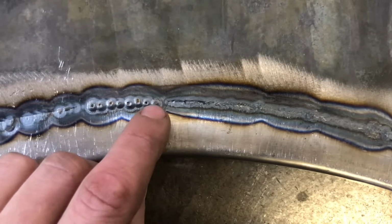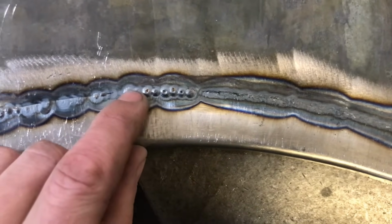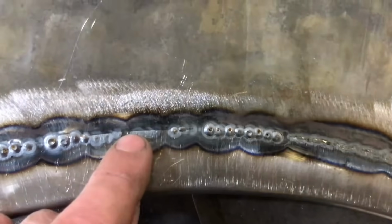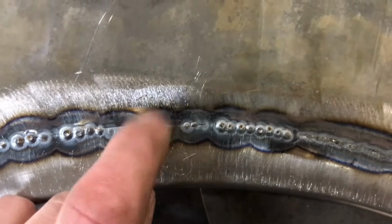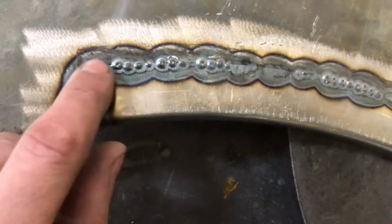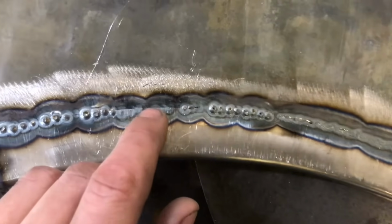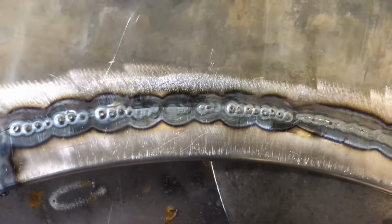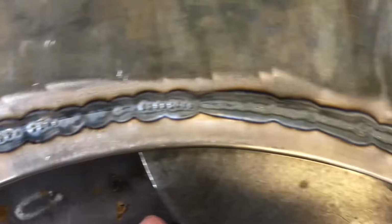We go over onto the MIG, this is what you normally get. So the ball's coming through the other side. And as I said, where it went a bit cool, it hasn't made that joint there. You see, that's a cold edge. But then, as we've gone round, we've got penetration through there. So I'll grind all this off anyway. This can be just a realistic error, and we'll see what it looks like once I've cleaned it all off.